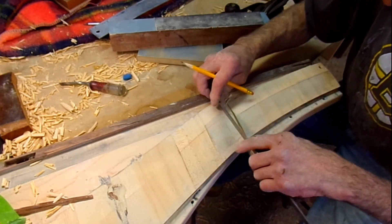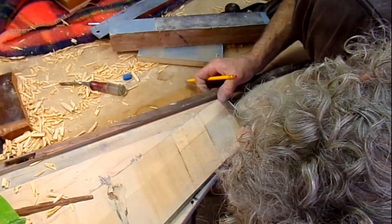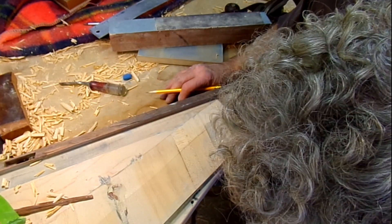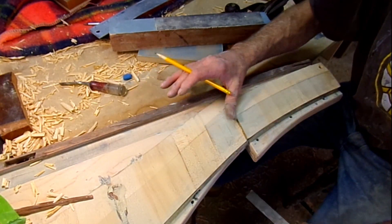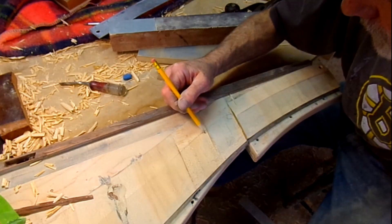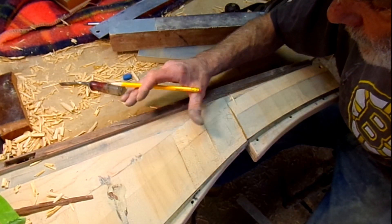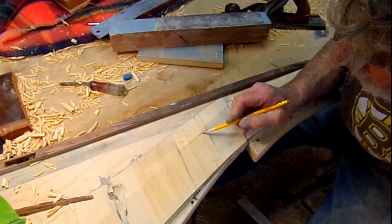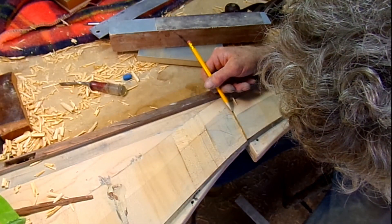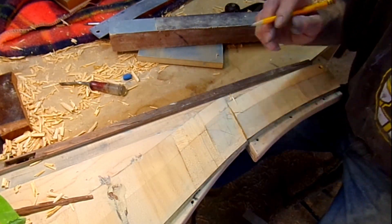So what we've got to do is add a piece of wood. See — about that much right there. I just can't put a piece of wood there, it wouldn't be right, because my veneer is going to overlap this. So I'm going to take a piece — I've got a lot more of this here — and custom fit it in here, up to here, because that's where our slope is ending. This could come down slightly, but not much more. So I'm going to have to cut and come up to here with this addition, and raise this up a little bit. It's supposed to end right there. So we'll add a piece and then we'll come back.